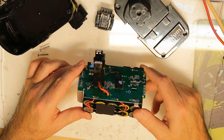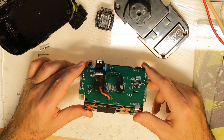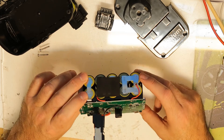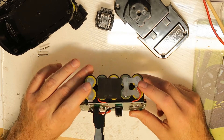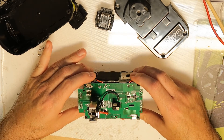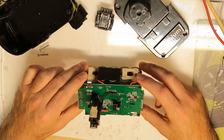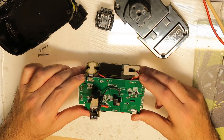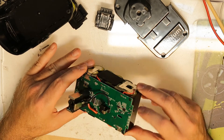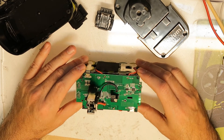So we have all the balancing connections, and this is the main positive and main negative - pretty nice job they did. The capacity of these cells is just not so good. What I will do is insert brand new cells and assemble everything back, and hopefully get much better results because the protection and the BMS is pretty impressive. I can trust this battery by the build that I see.